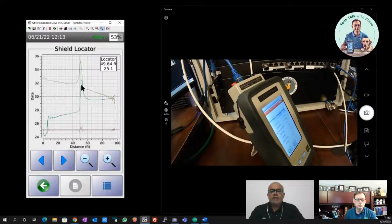This is a big discontinuity in the shield, and that's what you just described, that maybe only a little bit of shield is left. Or, as we discussed earlier, if the component is actually unshielded but there is AC continuity, you see something like this, which is very evident that this is a problem that needs to be fixed. Right. So in the real world, if this cable was in a normal commercial building cabling system and had damage like this, excessive noise from a wide variety of sources could get into this cable and cause problems with it.